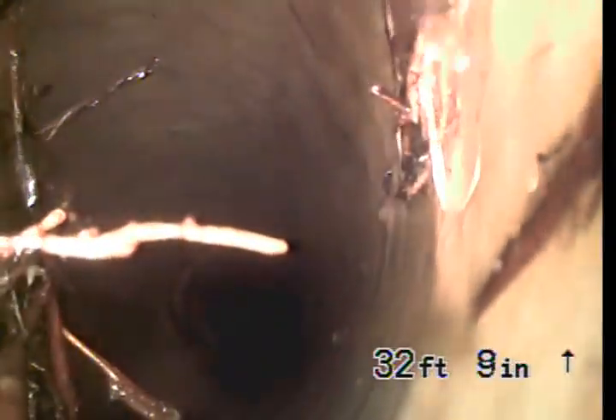That's basically what's going on with your line. Also, where they connected the four-inch ABS pipe to the six-inch epoxy-lined pipe, their connection is bad — roots are growing in at that point as well. They didn't do a good job right there. That's straight ahead under those trees. Where they connected that pipe to this pipe, they didn't use the proper materials, or something happened to where the roots are growing into that connection.